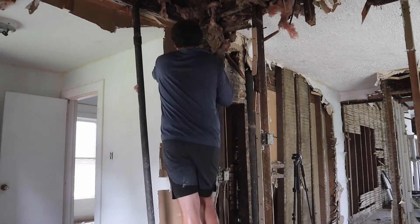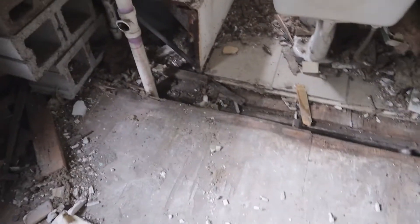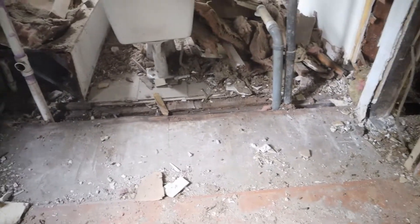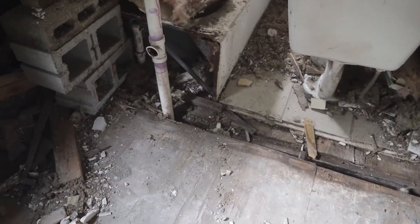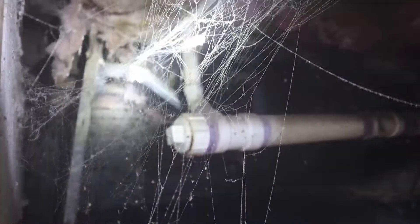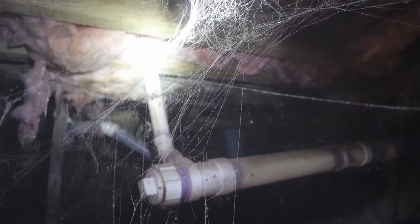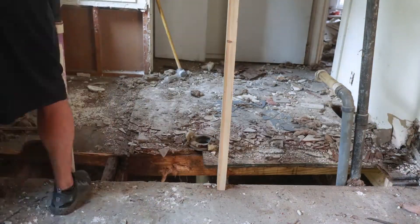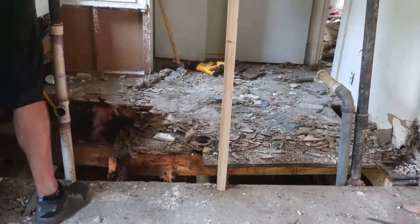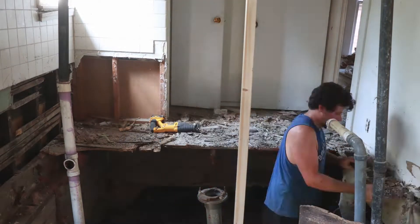Unfortunately, I got to the end of taking out this wall and realized this addition has more problems than I thought. For instance, the wall was apparently structurally providing some stability to the floor, because when I removed the wall, suddenly the floor has a big sag in it — and that's not a good thing. A really basic building technique is that the stuff on the bottom supports the stuff on the top, so floors support the walls and not the other way around. So I figured I would go about taking out that floor. There's tile on top, and also plywood, and then the subfloor, which is 2x6s. They were actually put in properly, but there's some rot situation going on, so the floor had rotted over time and all just needed to be replaced.